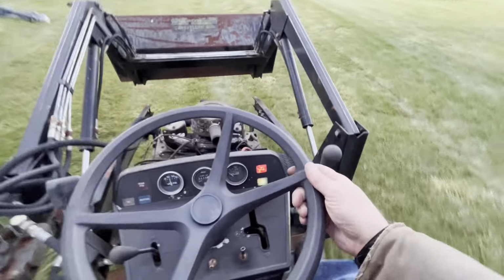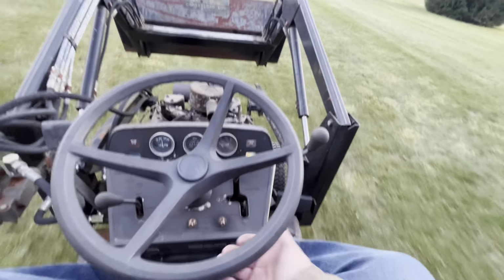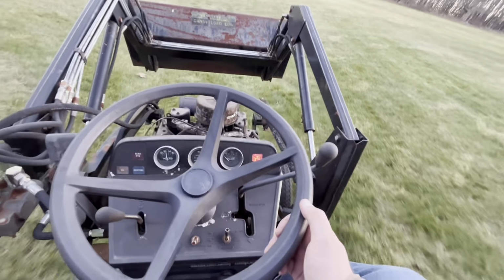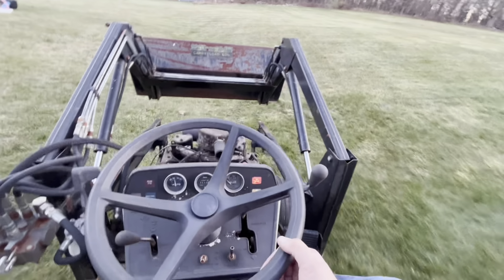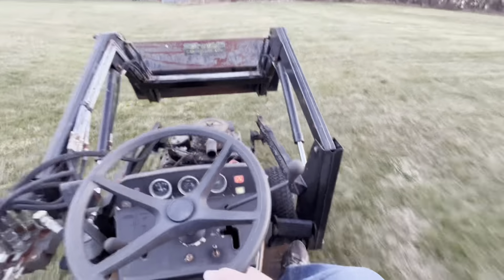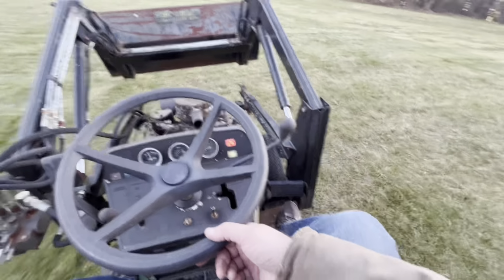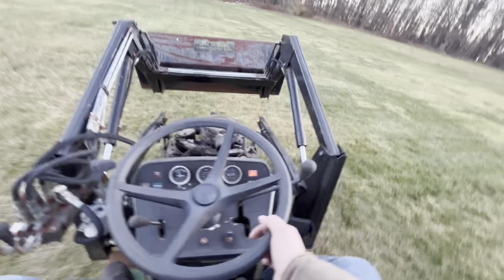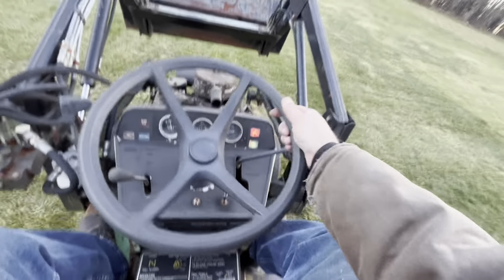Or whatever that said, turn it on and off 30 times. I don't like that I got less than 12 volts. I still think something's screwed up with the charging system, that we dropped the magnet or the stator's messed up or something, but it's working for now at least.